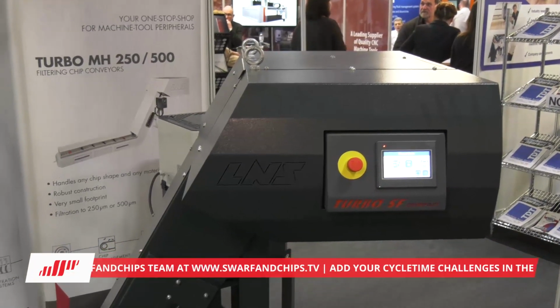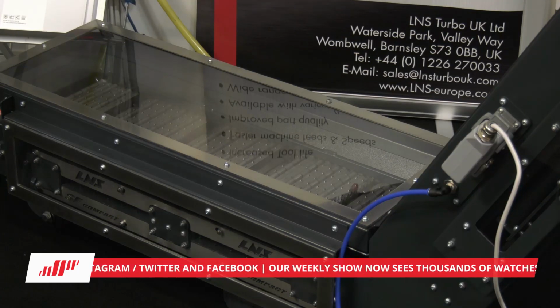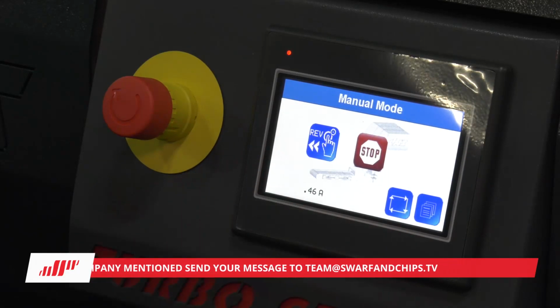Now, one thing you're showcasing here is the swarf conveyor. What's so special about this one? This is the SFC. Everyone knows of the drum filtration, microfine 2 and 3 system that we do, 50 micron. But as we got here, this is 2/3 of the footprint, but also the price. Oh, I was going to say, so 2/3 of footprint is definitely 2/3 of price though. Yes, it is. So when people are buying big drum systems, additional coolant tanks, a majority of the time and high percentages, this will fit in the original tank. Right. So you can go from a clean out type conveyor to straight to a filtration conveyor that you don't clean out, it's self-cleaning. So downtime, minimal, uptime on spindle, maximum. Yeah. Make money.